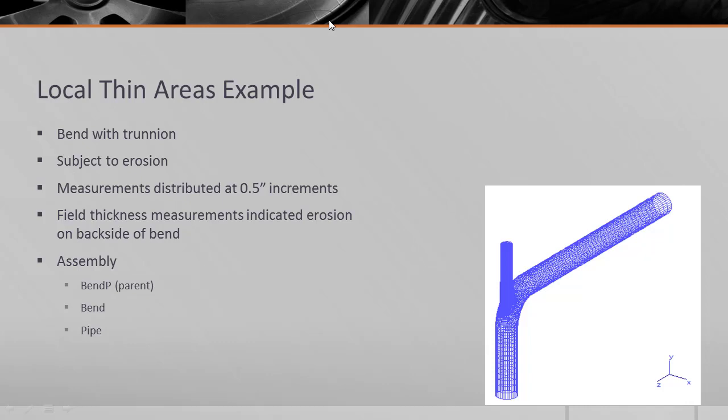When using this mechanism, you typically want to use a very fine grid wherever you have that reduction in thickness, because the software is going to linearly interpolate between your measurement points and you want to ensure multiple elements between measurement points to make sure you have smooth continuous stresses. Let's jump into the example and hopefully this will all become clear.